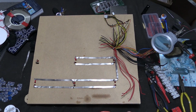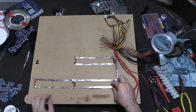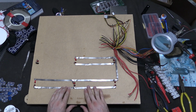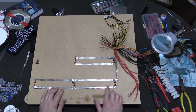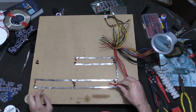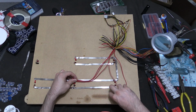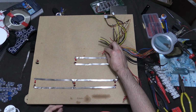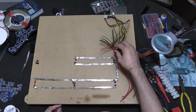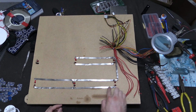So the next thing to do is to wire up the power supply to each of the PCBs. So I thought what I'd use is some of this nickel strip that I've used for wiring up my 18650s. And what that'll do is it'll create a bus bar at the bottom for the negative, and then the positive, which will go along here. And it just means that I can connect all these power cables, these 5-volt ones, along here, and some of them along here, and it makes it much easier for the shorter ones to connect through to the tops of here, because that's as far as they will reach without having to link between each of these positives. That might make it a little bit easier if I just use this nickel strip to do it.